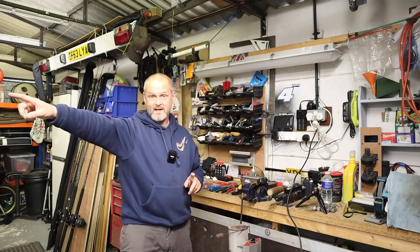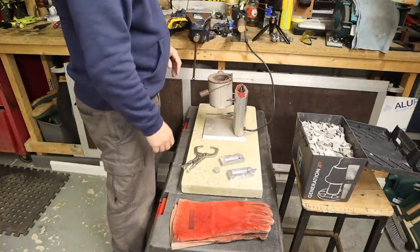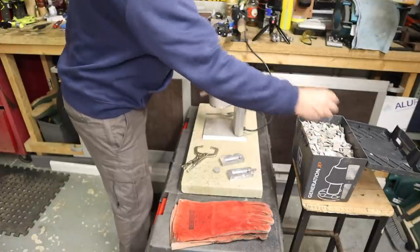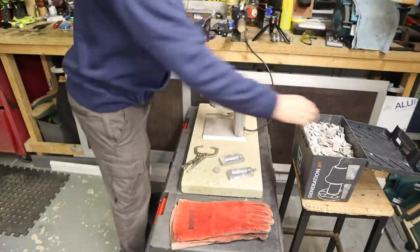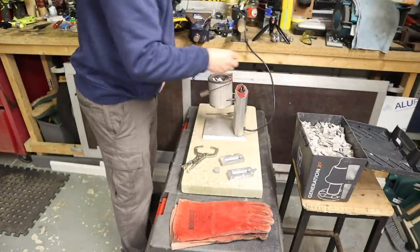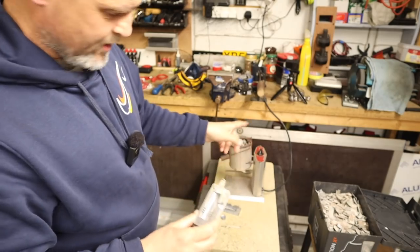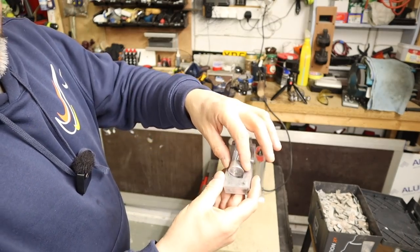I haven't restricted my access out of the door. I've got my lead pot and I'm going to switch it on - it's half full, and it's more efficient if it's full, so I'm just going to load it up. As I'm putting this in I'm checking to make sure it's not folded and has nothing detrimental in it - it's absolutely bone dry. Whilst waiting for the lead pot to melt I'm going to assemble the mould and pre-warm it, putting it at the lowest setting for the six ounce, 170 gram weight. Place the wire inside - it locates. Put the second half of the mould together, check that everything is actually trapped and located as it should be, then clamp it all together lightly - you don't want to distort it.